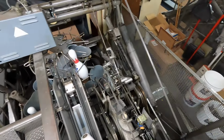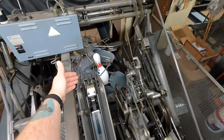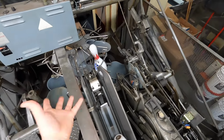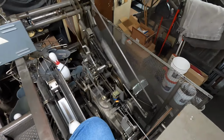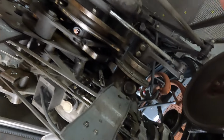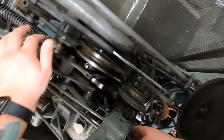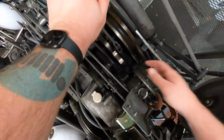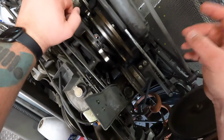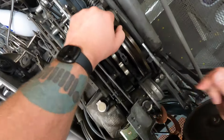So then at this point, you have the pin in there that needs to be respotted. It's at 180, but at the same time, you don't want to start the flow of the pins again into the turret, because then you're gonna get a double pin and then you're gonna get all the pins back on there. So, correct me if you want, but this link here that's connected to all of your linkage and your shaft, it's for the long link and deck signal and everything else like that. I just call it 180 lever because this lever kicks it out of a 180.